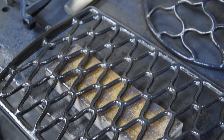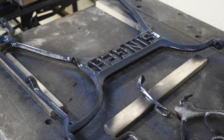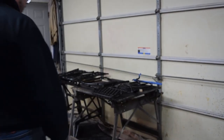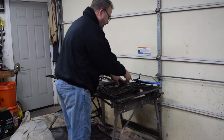First coat's on. Let's let the heater do its thing. Get back in here and shoot a second coat, flip it over and continue. So far, so good. We gave this first light coat on this one side about 4 hours to dry, and it has, with the heater running in the shop.